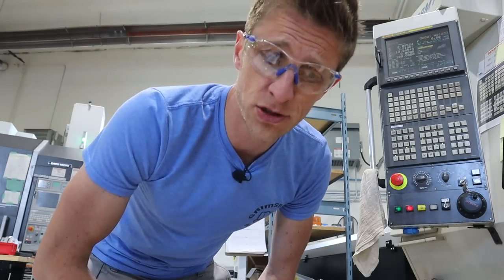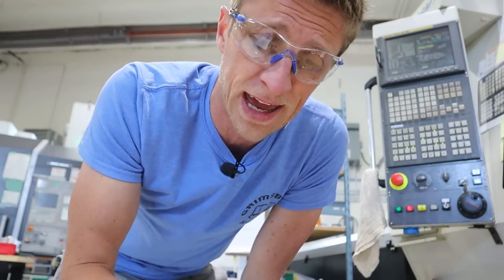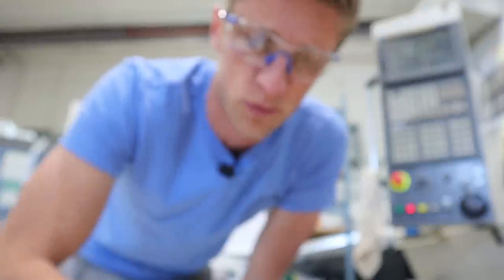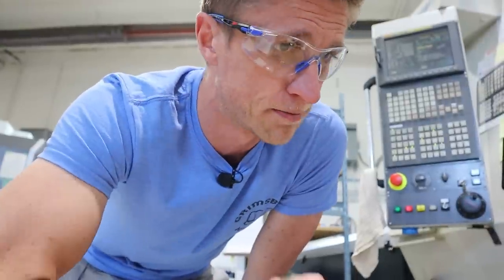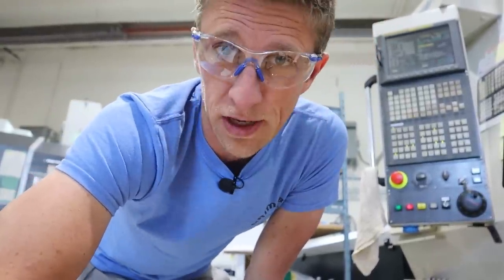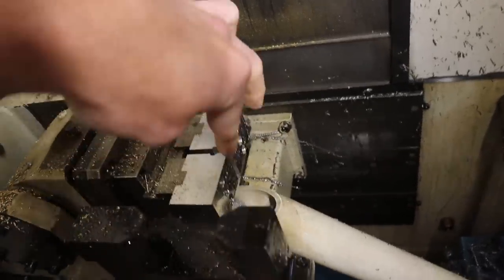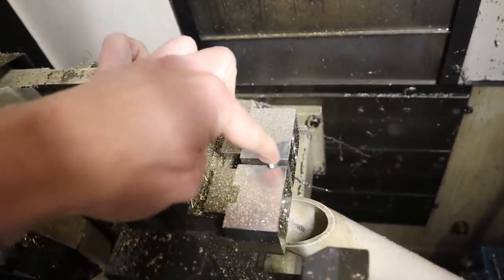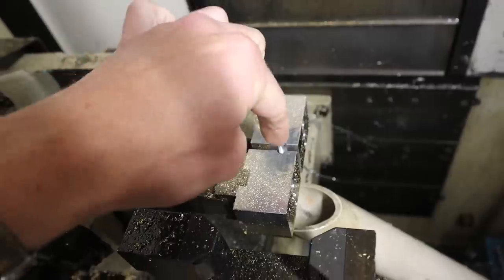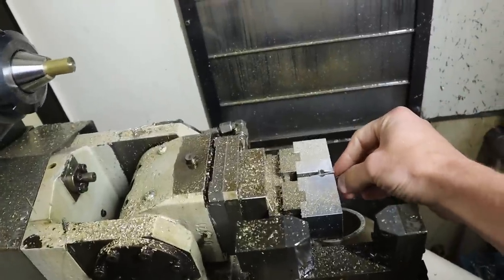Now is the time for me to cut some A2. The program is proven — I've made a handful, they look amazing in brass, but it's going to be way too soft. Let me show you something first: we have two aluminum vise jaws just screwed on. I bored a simple quarter-inch hole in there and I use these 50-thou or 75-thou shims. I put that in the vise, clamp the vise, then machine my feature. That way there's over-travel — without this in place, the hole could squish all the way flat to less than a quarter inch. So there's plenty of grip on the part.